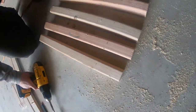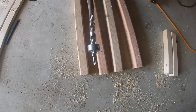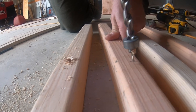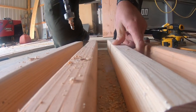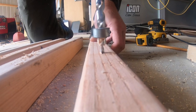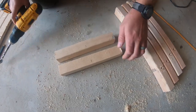And then, once we do that, we'll set our pocket hole jig up here to where it's about 1/2 inch to 1 inch from the bottom there. And we're just gonna drill down about 1 inch down into this, in the center on those 3¾-inch marks. That's not straight, well. Okay, and then on these ones, put those right in the center of these two.